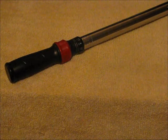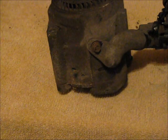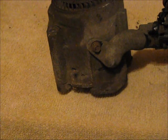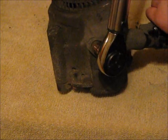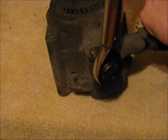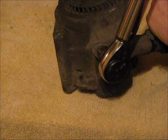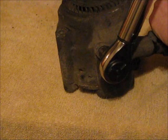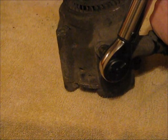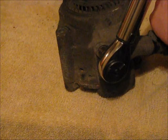This click lets you know the bolt is tightened to the torque the wrench is set to. You can feel it through the end of the wrench and you can also hear it — that's what you're looking for. You want to stop just as you hear it click.